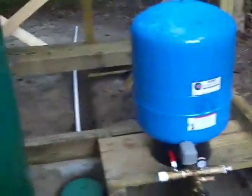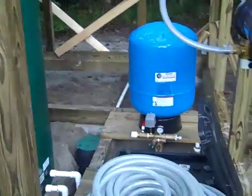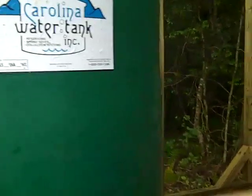This little building is going to be a bathroom, shower, and wash house. It's a nice structure, and the thermal mass of that tank should keep this building at a steady temperature — probably keep it from freezing. It'll be insulated, and that's a cool benefit of putting the tank inside: a thousand gallons of water at around 60 degrees provides enough mass to keep everything from freezing.